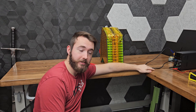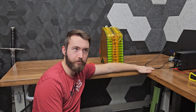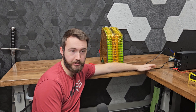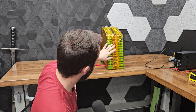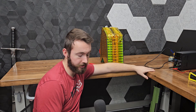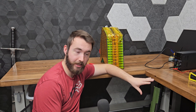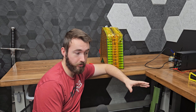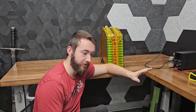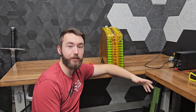I think it's a great way to make all your connections copper and fully get rid of nickel. There's no reason to be using nickel on high-discharge applications because of the resistance and heat buildup you get from it. I'm not claiming to be the first one to try this — I haven't seen anyone do it, but I can't imagine no one has. Let me know if you've tried it or tried other things to get around it. I think you'd also get away with spot welding the braid and doing a bolted connection with eyelets. A lot of people say bolted connections are better for high-amp applications — I'm not saying that's wrong or right, I haven't done the testing. It really depends on who you talk to, but you could definitely have success with either.